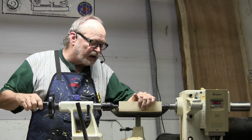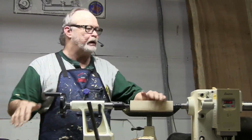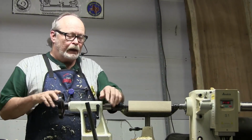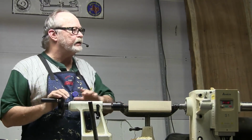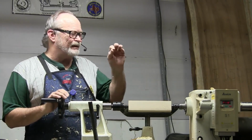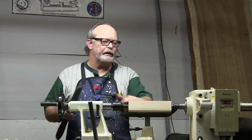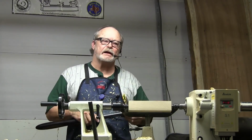Well, a lot of the cuts are finish cuts. 100 years ago, this was sandpaper and long grain turning. Even if you'd done everything with a gouge, come back and clean up and finish off with a skew. And you should be able to get a finish like that pretty easily. It was chippy because there's kind of a knot or an old branch in that, so I had to hit it again one more time. But you can even turn a knot. You can turn a knot where there's zero chip out using that technique.